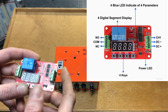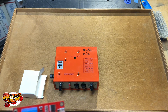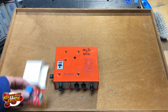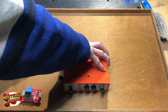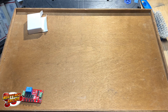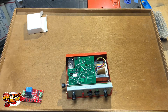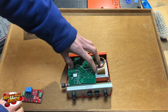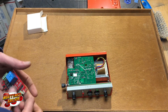This relay would then trigger the AC voltage, so I could use 12 volts to go through here, trigger the relay, and get AC voltage to work — which is kind of nifty. The problem with the game was you could coin it up and it would spin the teacups around forever and never stop. I think the control box had fallen down inside the game while trying to fix and rewire it, and with no wiring diagram it was just too much to figure out.